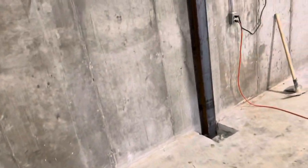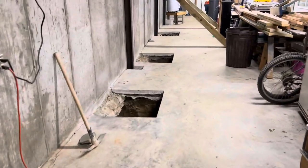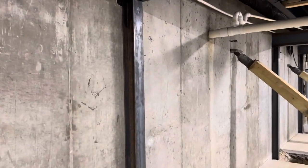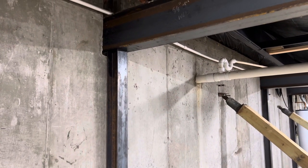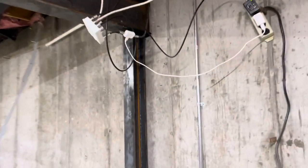We've already straightened the back wall — this was the one that was leaning inward. We've since got it pushed back to its correct vertical position and we've started getting our wall braces installed. Once that front wall is in place, we'll get the other shorter braces that are going to be underneath the front end of these horizontal load bearing beams and start getting those set up.